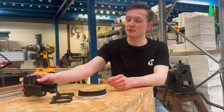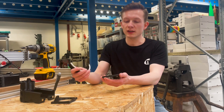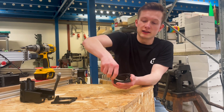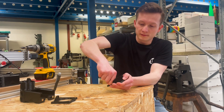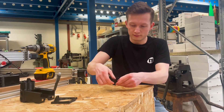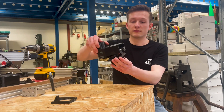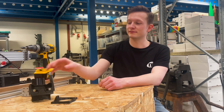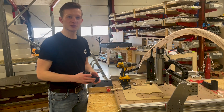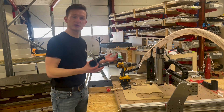We have the main parts assembled. The last piece is to insert the brush strip into the brush holder — just take the end and push it down into the groove and proceed all the way around until it's nicely seated and feels secure. Now you're done with the assembly. Next I'm going to show you how to put on the dust shoe, make the final adjustments on the big magnets, and how to assemble it with the hose.